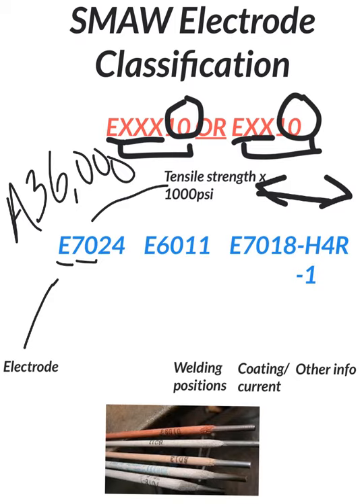So we're talking about a filler rod that is a lot stronger than the base metal. It does have to be welded correctly — sound, no slag inclusions, no porosity, no cracks, anything like that. But yes, our filler rods are stronger than our actual base metal, and that's a good thing.